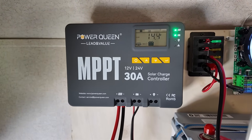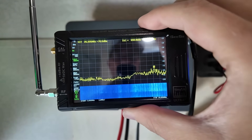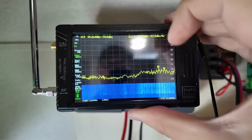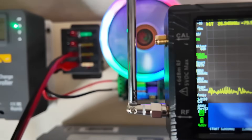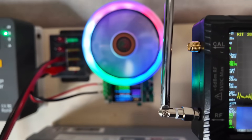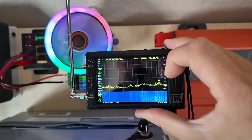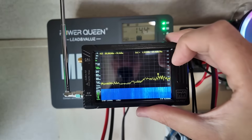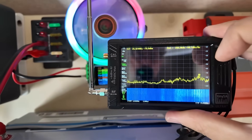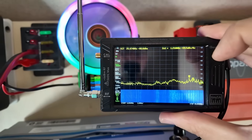One of the first things we have is a solar charge controller. We are at minus 75 dB over here where it's starting to hear some noise, and you can see some chatter on the waterfall. Right next to that we have an unshielded electric load device that's converting battery energy into heat in the room, and we can see we still have that same noise up there — it's actually a little quieter. It starts to creep up in front of the solar charge controller, and we move away a little bit and it starts to go down. Minus 75 dB — that's fine.